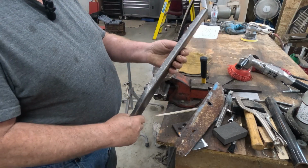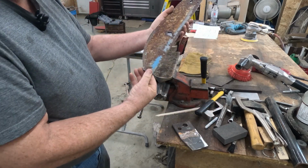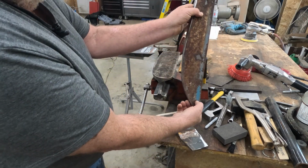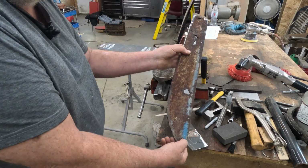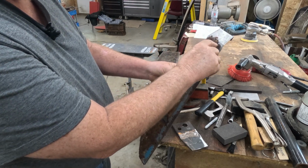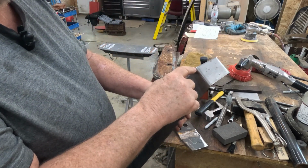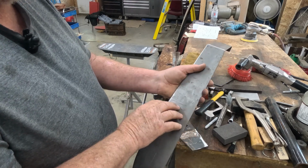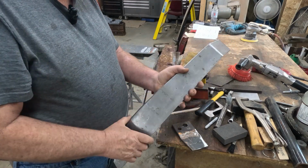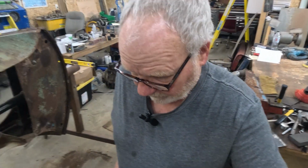Okay, I've got this piece looking fairly good. If I put the two of them together, the old piece and the new one, my lines are pretty good. I don't know if I got that on screen. I am a little bit long. I think my bend was back here a bit. So I think my fix for that, rather than trying to rebend all of this, is to do a cut through there, get the first piece installed, and then cut the other smaller piece down to fit it and just re-weld. That should work. Now we'll just come back over to the car.